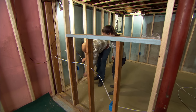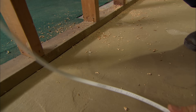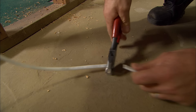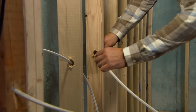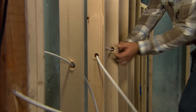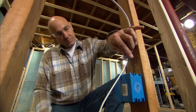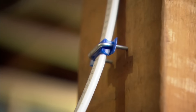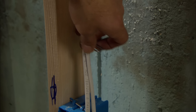We bring this right down to the floor and come over here. We need to leave enough wire to work with, so we'll carry it past the box to the ground and cut it. Let's spool out some more wire and connect the rest of the outlets together. I need to secure the wire within six inches of the box — for that I'll use a staple. For more than one wire, I'll use a longer staple.